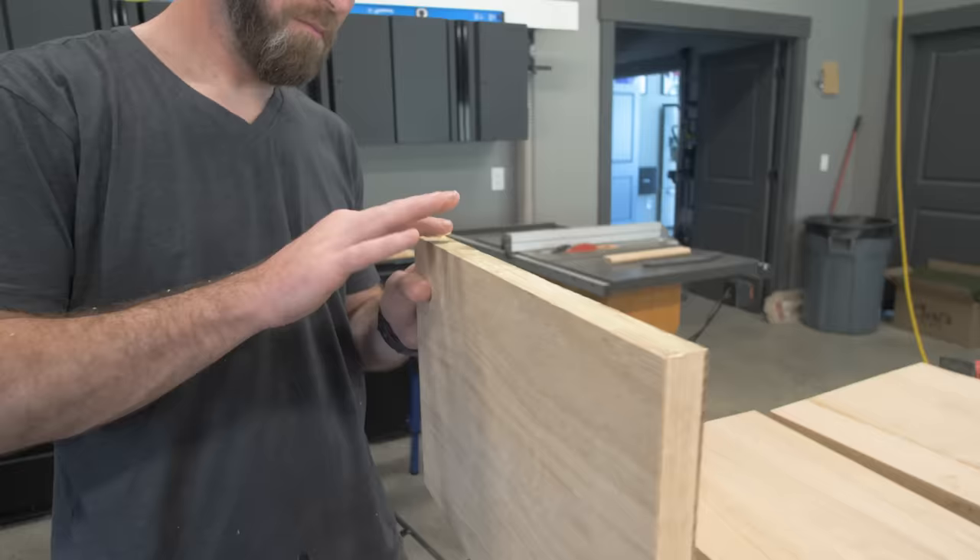The last step in the process was to come back and install the shelves. The shelves for the bookcase were standard red oak plywood, trimmed around the front with a red oak trim — I believe that was a half inch by two and a half inch trim piece. We did that on the two shelves for the bookcase, then went with a red oak plywood divider between the storage units trimmed with a 1x2. All of those shelves got secured with inch and a quarter pocket hole screws.